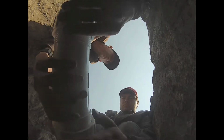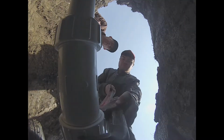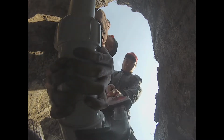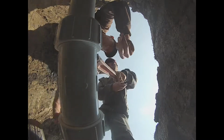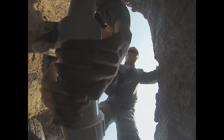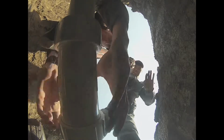Now we're going to hand tighten our end caps. Now I'll just tighten up each end cap with the pipe wrench to make sure that they're not too loose but not too tight, because we don't want to strip the threads, and plus we want to make sure it's tight enough as well so that we don't get any leaks, so that our compression coupling doesn't come undone.